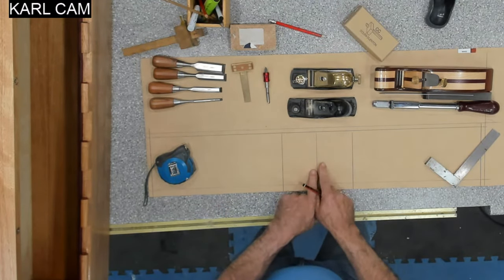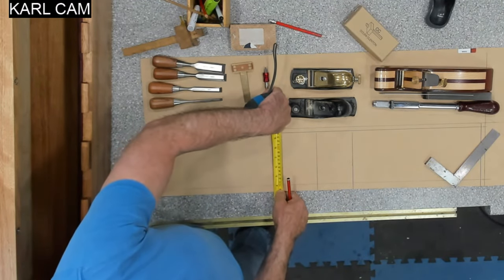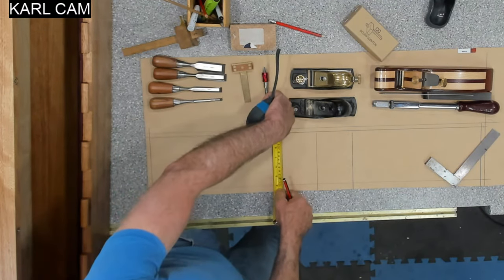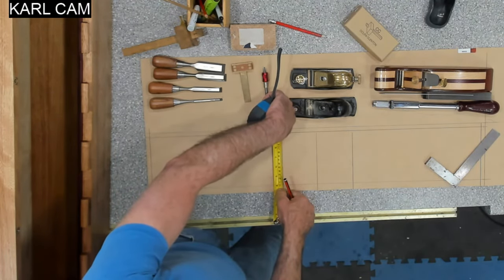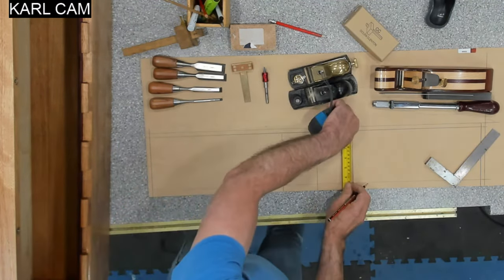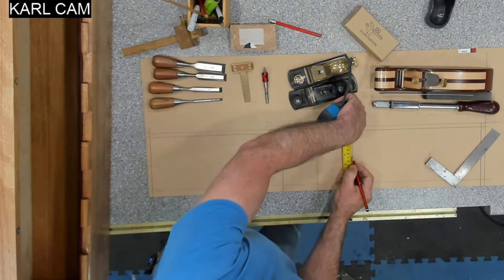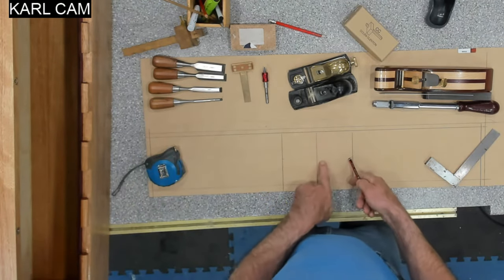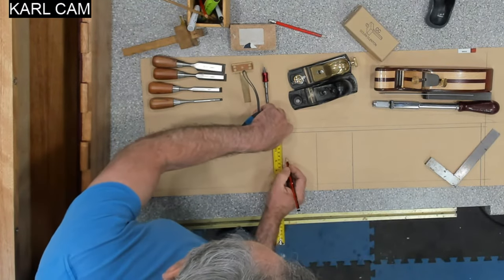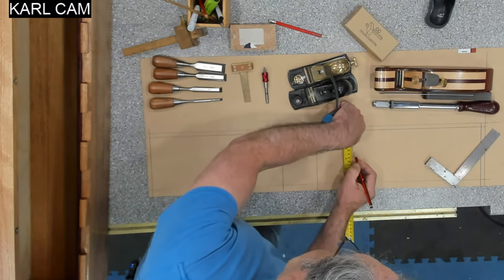and it will be 18 as well. So I'm going to go down the middle of here, 18. So center of that is half of 138, half of 140 is 70, so it'll be 69 will be center. 38, 69 is the center again. That's the middle, and let's say we're going to make it 18 millimeters thick, is 9 millimeters either side. Down to there, 9 either side.